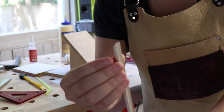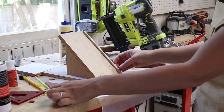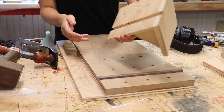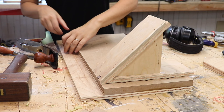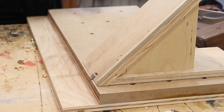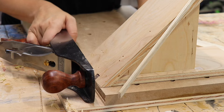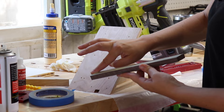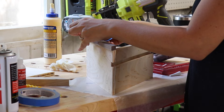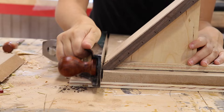I flipped it over and did the same on the underside. It just needs a fence on the edge so your workpiece references a square edge. I thought CA glue alone would be enough for that fence — spoiler, it wasn't. I made the groove on the bottom to attach it to the jig, but there was an issue: the main fence was sticking out through the opening in the groove, preventing a workpiece from lying flat. So I used my hand saw to cut the little corner of the fence and chiseled it clean. After the fence broke off, I made a sturdier, thicker fence, glued it to the edge of the plywood, used painter's tape to hold it, brad-nailed it, then used my hand plane to get it flush with the jig.